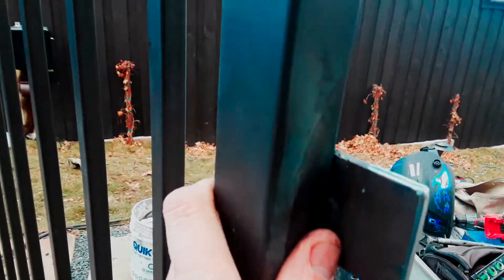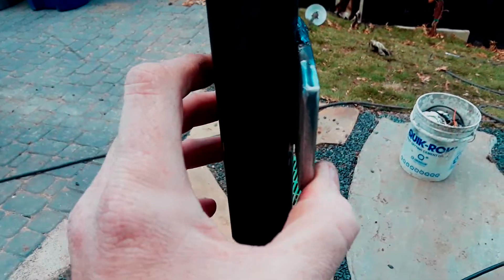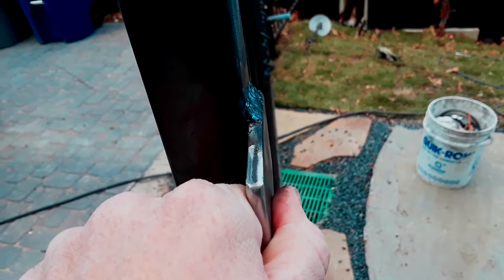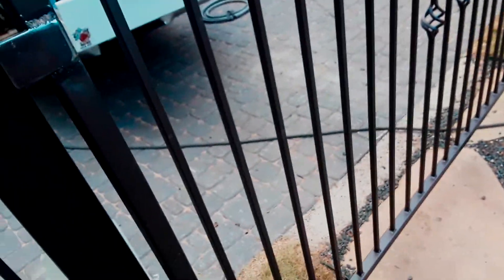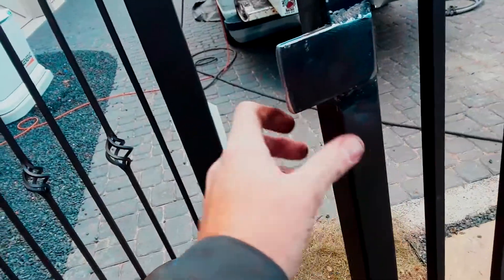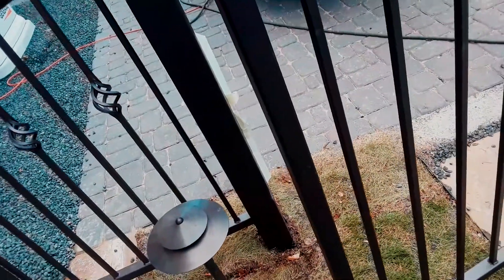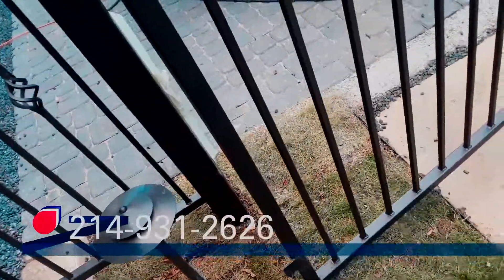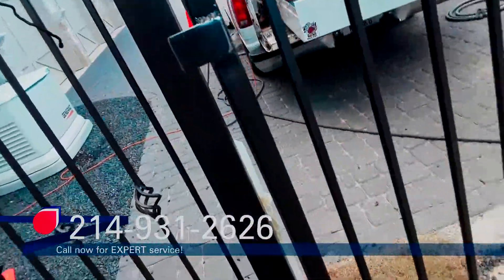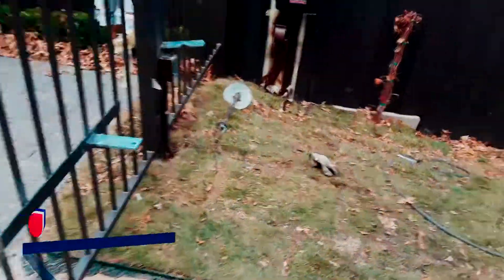I just put a little bead on the front and smoothed it off, just in case somebody walks by — that's why I put the stop plate on the gate as opposed to the latch post. The latch post is always standing there and it could get caught on somebody's clothes if they decide to walk through, even though it's a vehicle gate not a pedestrian gate. I've got that cleaned up and ready to go — just needs a little bit of tape and paint, and we'll start back over here on the actuator cable.